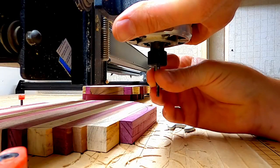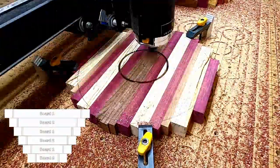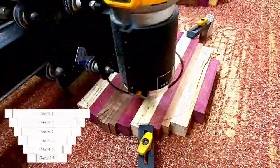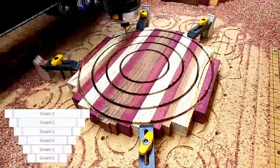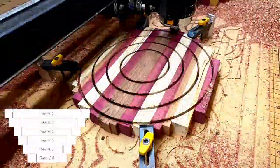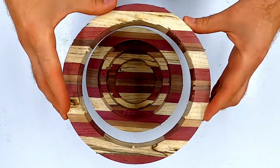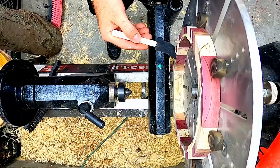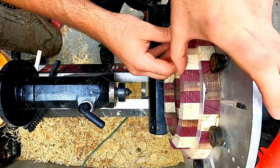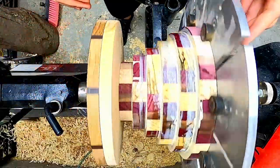From here I took the boards and set them up onto the CNC. I pre-designed some cutouts in my V-Carve program. I only show one carving, but I do carve two of these panels. The circles, however, are offset when stacked — I did take into account the cutout material, which is one eighth of an inch.